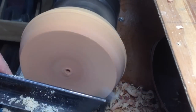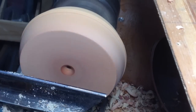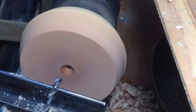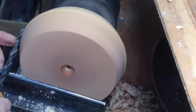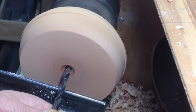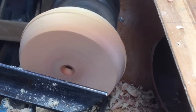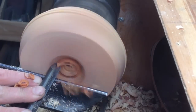First thing is to drill a depth hole. Do a little starter hole with a 3/8 spindle gouge, and then this is a fairly aggressive depth drill — about 8mm. The 6mm one is better; it doesn't go quite this deep at the moment, so I need to stop just shy of the mark. We'll start off roughing the interior with the 3/8 bowl gouge — deep fluted bowl gouge, 3/8 flute.